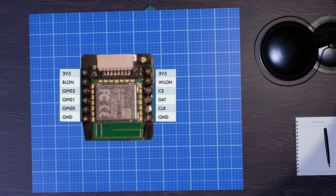We can interface that directly into any Raspberry Pi chipset — RP2350 or RP2040 based boards in different formats. This is quite nice because I can do different shapes, formats, and smaller potential boards than I could possibly do using just a Pico W or Pico 2W. I also get the ability to use those three GPIO ports available on the module in any format I wish. It's a 3.3 volt device, nice and easy to configure and connect up.